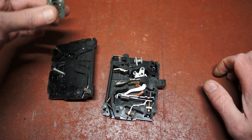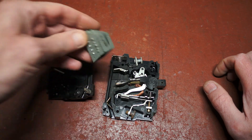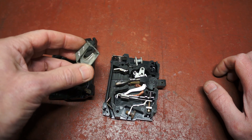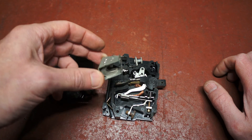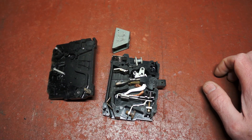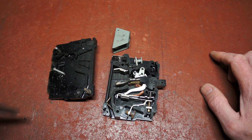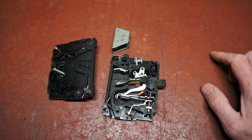There's also this little arc quenching duct, which sits in there, and it's got five metal vanes in there which act to deflect the arc and control it. Because when the circuit breaker trips, there can be a very high fault current, and that basically generates a small explosion. And like any explosion, pressure builds up and it has to be released, otherwise the whole circuit breaker would blow up. So you've got this ducting channel down here to let the gases out.